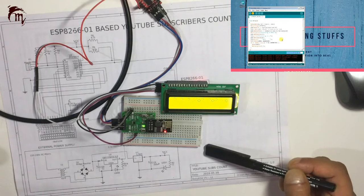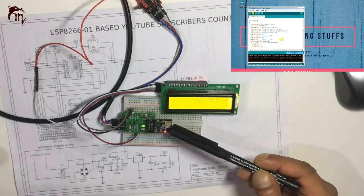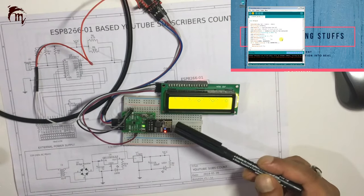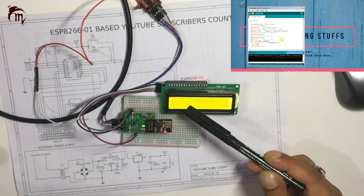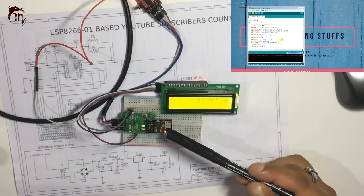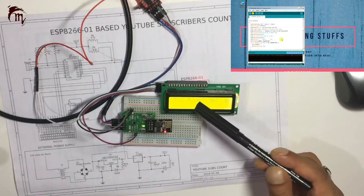It's taking too much time to upload, but we wait for it. Now see, let's start uploading. Fine. As soon as you are done with your uploading, your ESP will start connecting to your home Wi-Fi network, whose credentials you have given in the code. Then it will go to your API key, verify it, then it will go to your channel ID or your channel name, then it will fetch the number of subscriptions and try to display it on the LCD.